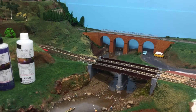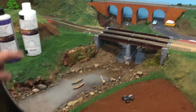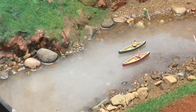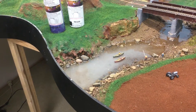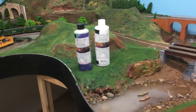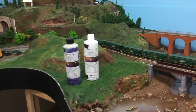It was done in three pours. The first one was very nice and it's come up extremely clear. But the third pour, the liquid seemed a little bit stiff, and I think it's come up fairly cloudy. The results still aren't unreasonable. But if I was to do it again, I would suggest that it might help to put the resin in some warm water before attempting to mix it up.